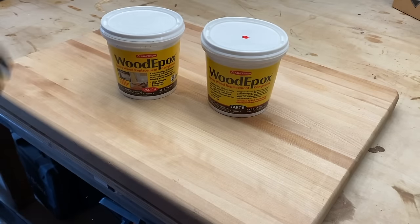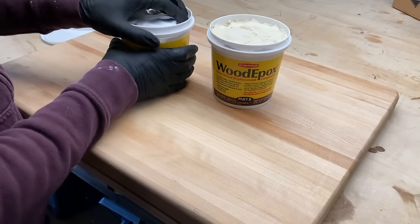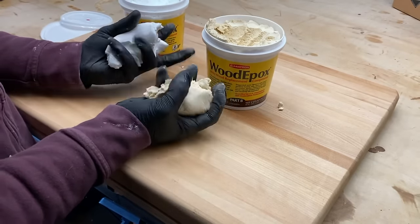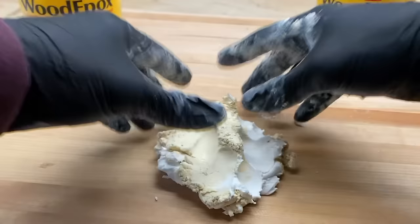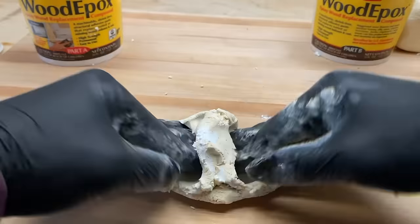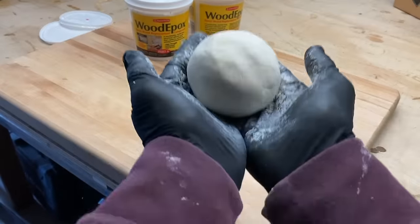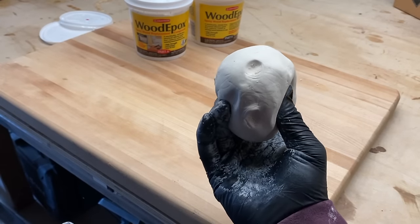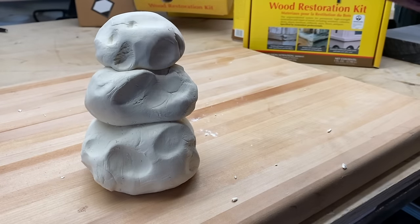If there's anyone who loved playing with Play-Doh, this is the product for you. Wood epoxy is a two-part product that is very light, but you take an even handful of both parts and basically just smoosh them together. They don't have to be perfect amounts — you don't have to literally weigh each product individually. As long as it's generally close and mixed thoroughly together, that's the most important part. The nice part about mixing these two together is that they're two separate colors, so you know exactly when it's thoroughly mixed because it becomes one even color. Once you have that uniform color, you are ready to start filling your hole.